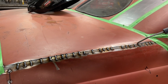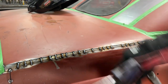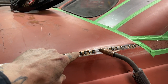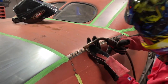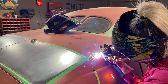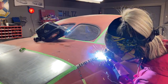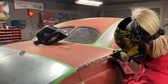And then when I went back at the weld, I would go in between the places where the welds are the furthest apart. So for me, if I was going back and welding, I'd go back there. And then up in there, exactly. That's where there's no weld, so that's where there would be no heat. Makes sense to me. Also, keep that wire in the middle of the puddle. If you have to go a little bit slower, that means you have to go a little bit slower. That's basically it.